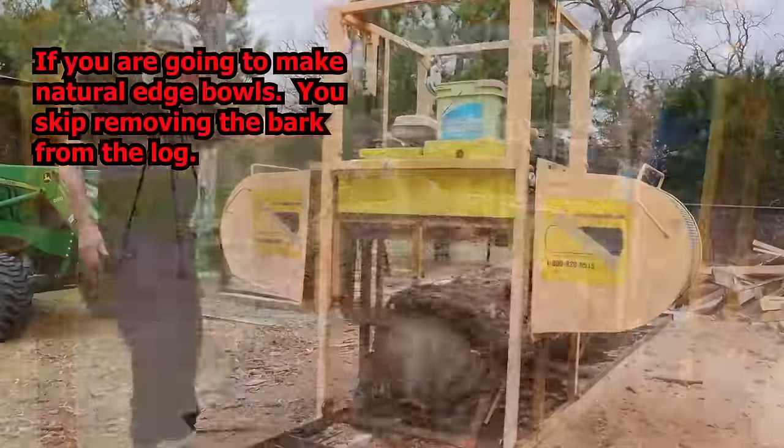So we're going to come down here, and I've got some beautiful grain right here. It is some beautiful spalting of the wood. And I'm thinking that given my undercut here, 8-inch is too big, but I can get a beautiful 6-inch. I've got a little end cracking I'm going to avoid here. So right there is what I want. And there's a 6-inch bowl blank with some great spalting inside of it. Now, always when you're doing this, mark the center so that you know where the center is. To keep you from having to go back constantly and measure these to see what size they are, I write the diameter of the bowl blank on the bowl blank. It just saves you a lot of time later on.